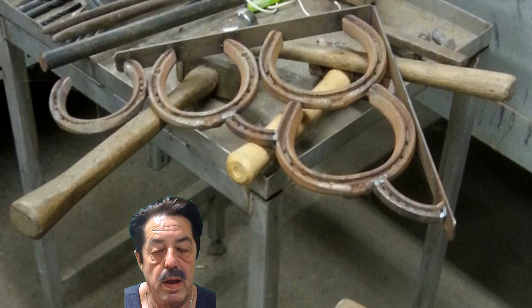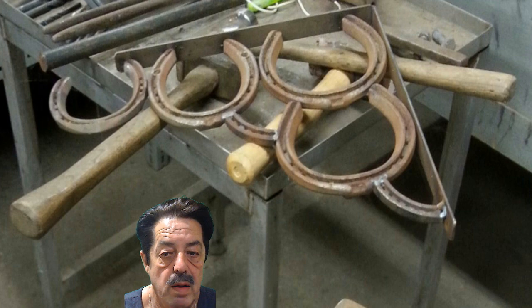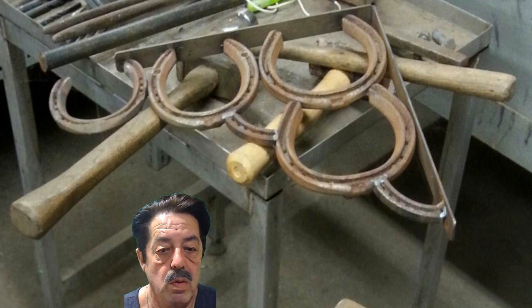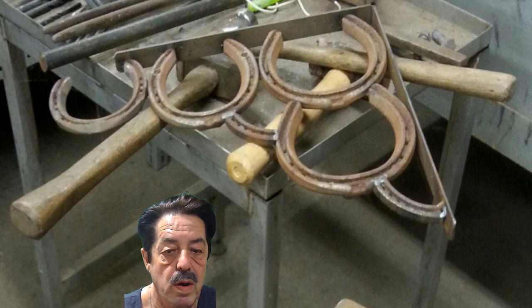I took the picture off of the web because I don't have one handy out in the shop, but this is the pattern that I used a long time back when I started making them out of horseshoes. What you want to start off with — like I've always said — don't go to Home Depot, Lowe's, or the hardware store and buy steel. Go out to your steel supplier; you're gonna get it a lot cheaper. I used either one or one-and-a-quarter inch wide steel, probably about a quarter of an inch or a little less in thickness. It doesn't have to be real thick, and you can bend these and make the L-part just out of flat steel, or you could even weld it right there in the corner out of two pieces.